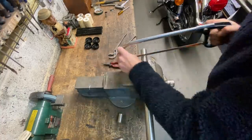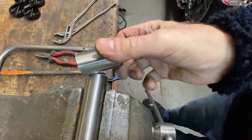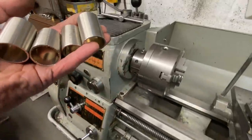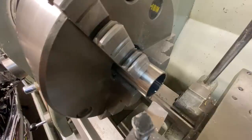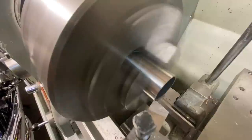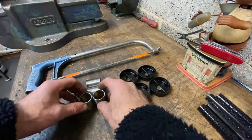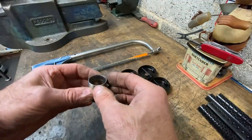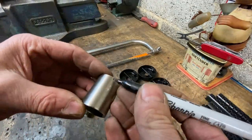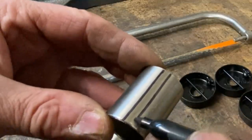I grip the larger diameter pipe in the vice and saw off four pieces about two inches long each, then take them over to my lathe to machine the ends square. After cleaning up the ends I notice they look a bit big in diameter, but that's not a problem — I'll just slice each one down the length, squeeze it in slightly, make it round again, and then weld it up. When I bore the end caps out I'll push them in and weld them in and it'll be just fine. I mark two lines with my Sharpie pen just by eye.